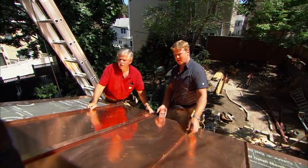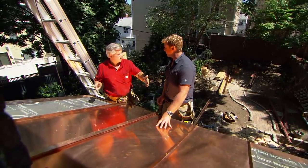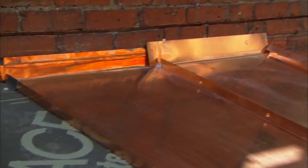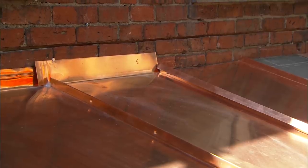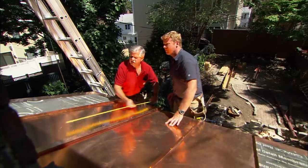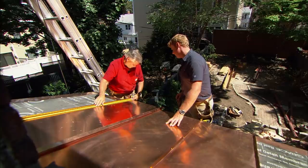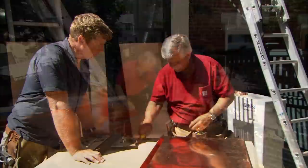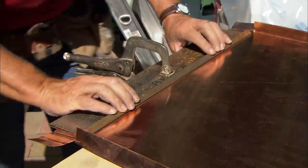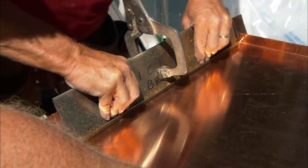Did you fabricate the panels yourself? Is this custom? No, I actually have a shop that fabricates my panels for me, and they oversize them, and then I customize and fit them on site. So how are we going to get this guy in? Because we have a building that's brick and old — it's a little irregular. So I'm laying it into position and I'll take a measurement right here to check it on each side. It's not too bad — about an eighth of an inch difference. With the panel on the table, I'll mark the length, then use some snips and a handbrake to bend the panel to match the pitch of the roof. That would be ingenious.